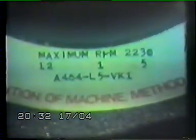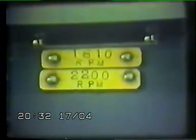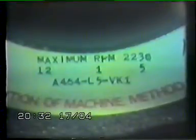The regulation states that every abrasive wheel should be properly mounted. So now let's see exactly what that means. Make sure it's the correct wheel for the machine it's going to be used on, and check that the speed on the machine does not exceed the speed marked on the wheel.